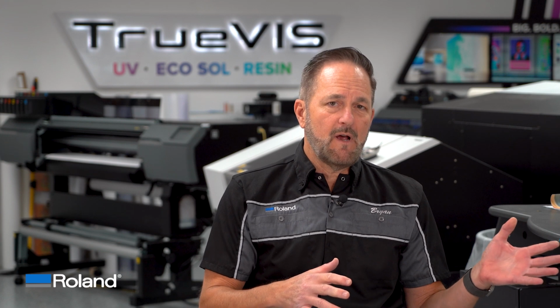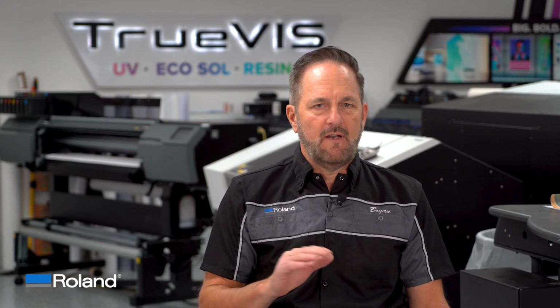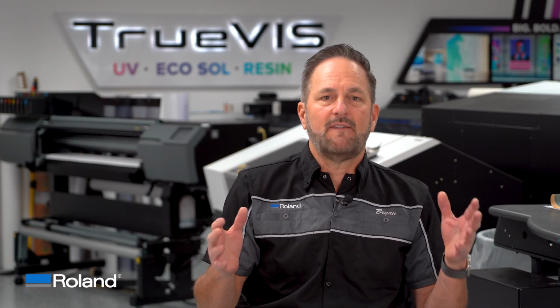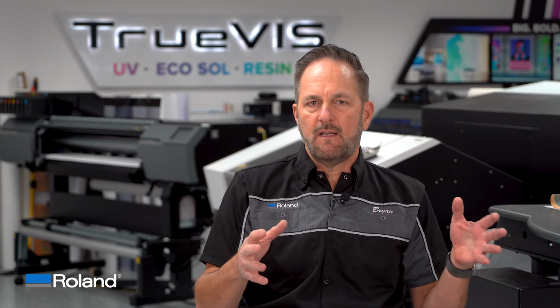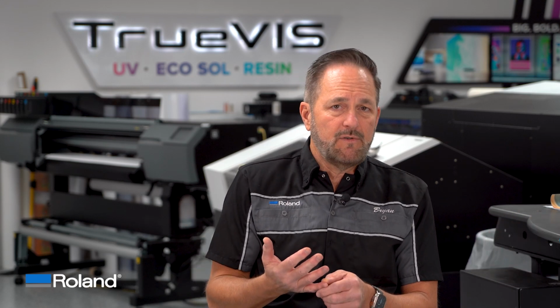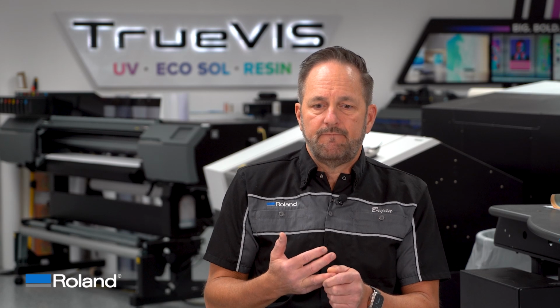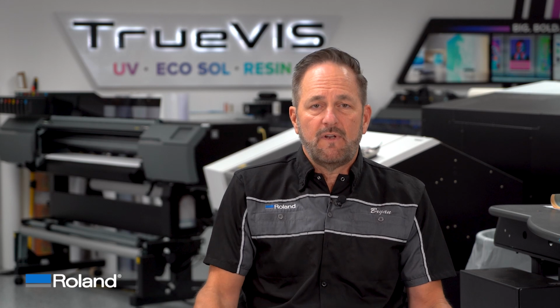I hopefully have covered the topics that you guys will need to correct for any kind of media misfeed. Again, it's an inevitability. A lot of the times it's nobody's fault. It just sometimes happens with certain materials, and there's nothing anyone can do except make corrections for it. And the only way to do that is, again, taking your time and patiently aligning the material to correct for any introduced skew that could be from the material manufacturing, could be due to humidity and environmental issues around the printer. Honestly, there's a myriad of other issues that can be involved that cause a skew to occur. But like I said, the good news is today we've covered those topics.